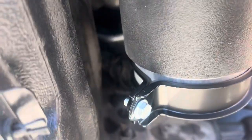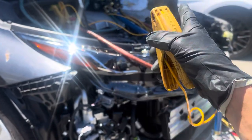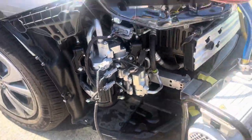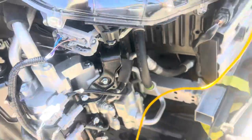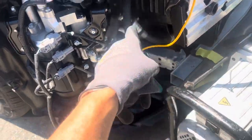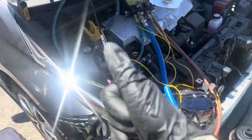I might be able to get my gauges right there, so it won't be a perfect superheat because it's going through a muffler and there's going to be a little pressure drop — that's going to knock a few PSI. I would have to use my little remote Bluetooth tiny nose ones to get a clamp on, but I'm not going to set that up now because I already have the software running. So I'm going to do as good as I can and get kind of a screwed-up superheat — a little lower than actual, just because of the length of line going through a muffler. The restriction might give you a PSI or so drop, reducing the temperature by a degree or two.